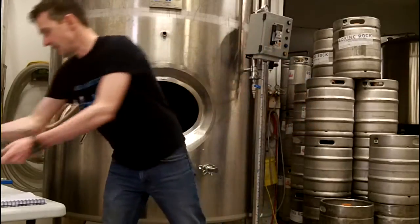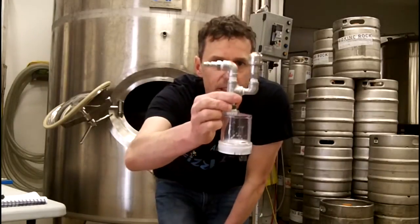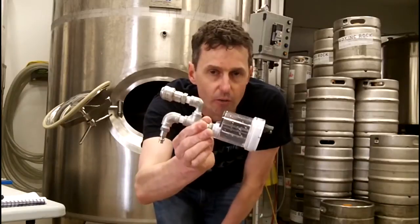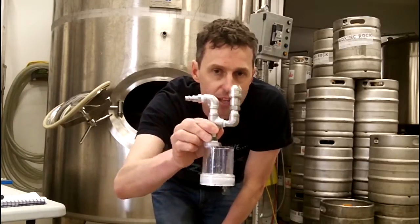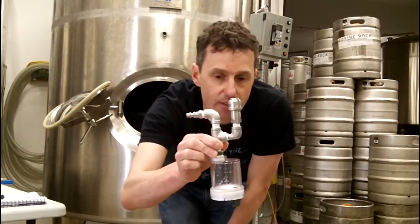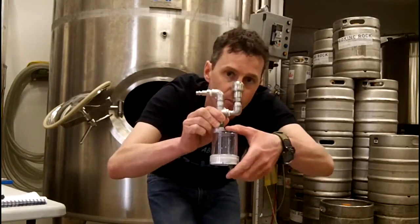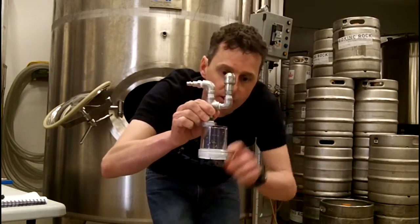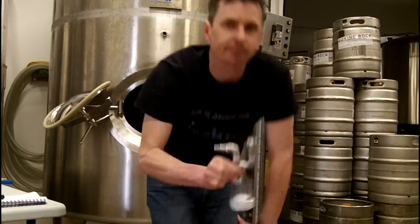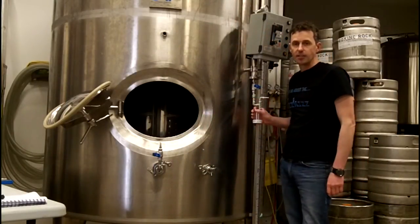You get a modification adapter — we call it a separator — which plugs onto the bottom of your CIP arm. The idea is that it separates any condensation or beer from foaming that you might have in your arm, and drops it into this sight glass. At the bottom it has a little sniffer valve so that you can just clean this out. If you ever get beer in this, it means that you are carbonating too quickly. This simply clicks to the bottom of your CIP arm.